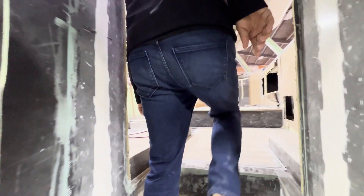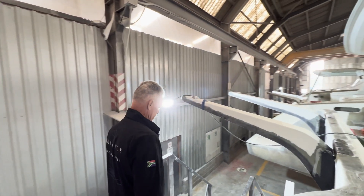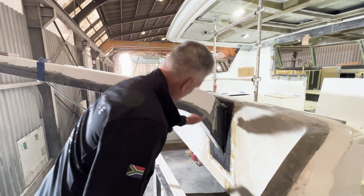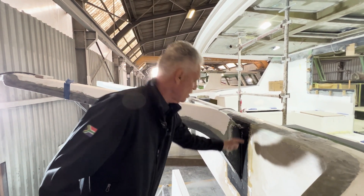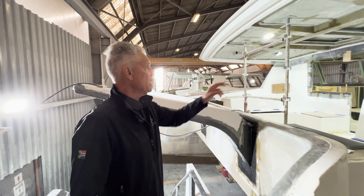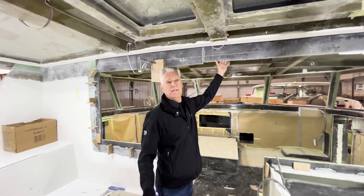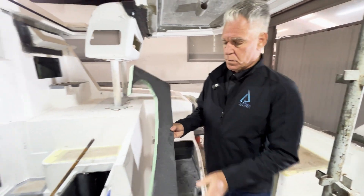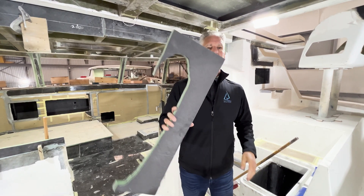Walking back on the starboard hull — here are your davits. You can see foam, e-glass, and carbon wrapped all around the bottom structural edge, because you're carrying a lot of weight and load here. There's a big carbon patch that runs over there. To really stiffen the boat — looking back, you can see the carbon doorframe hat track, another carbon panel. Here's actually just a piece of carbon cut out — it's really quite amazing how light it is.